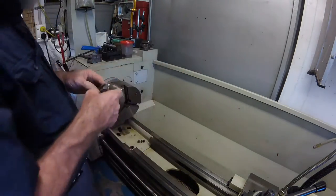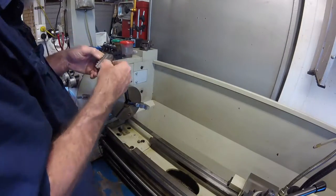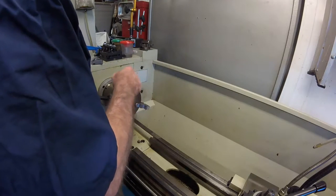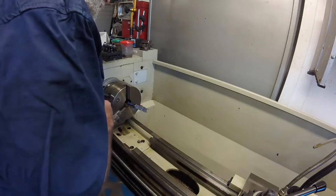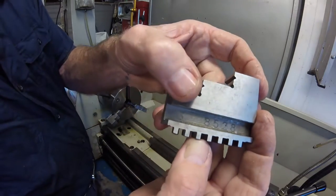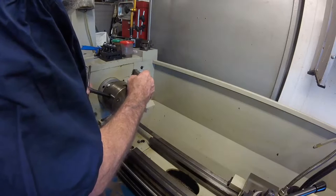In a three-jaw chuck, there is a scroll that rotates to draw the jaws in. The scroll's entry point must be aligned with the slot for each jaw to drop into in turn. The jaws are numbered 1, 2, 3 and are introduced in that sequence, lining the scroll entry point up for each one as you go.